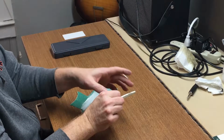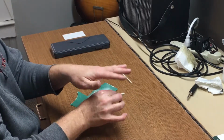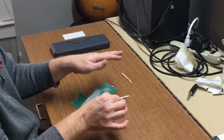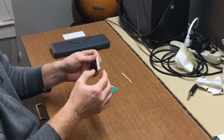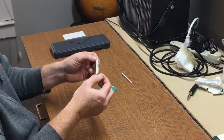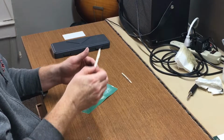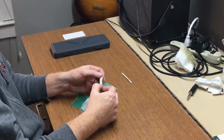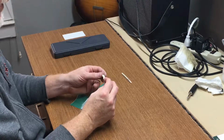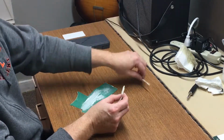We'll fit it in the guitar, put the strings on, and just measure everything. We'll have to loosen the strings several times, take this out, and do some fine tuning to get it down to where I ultimately want it, which is the 80 to 90 thousandths range for the string height. But we can dial all that in. This will just get it close to what it was on the old one.